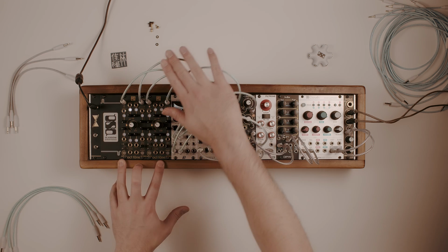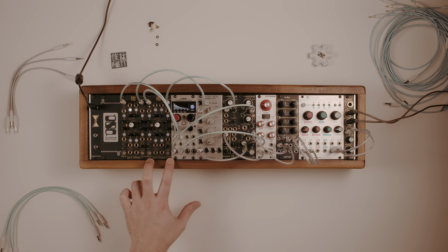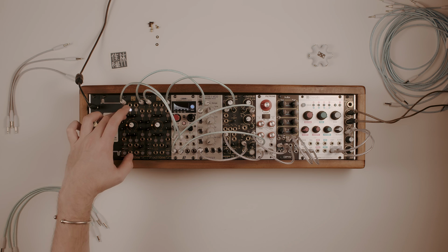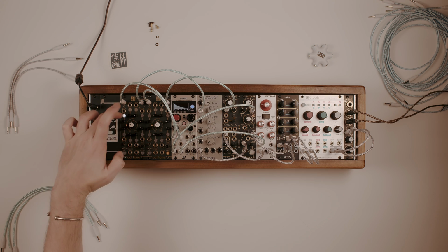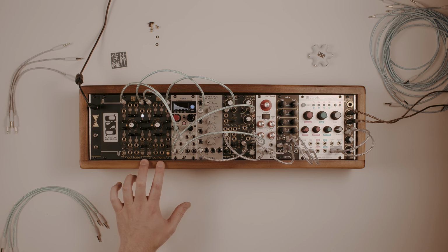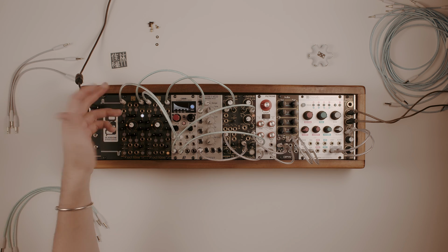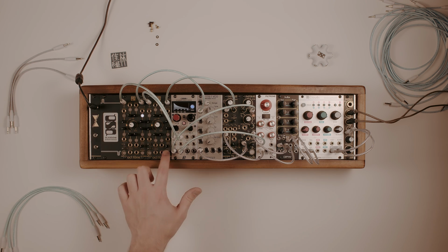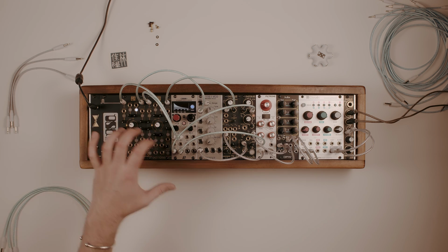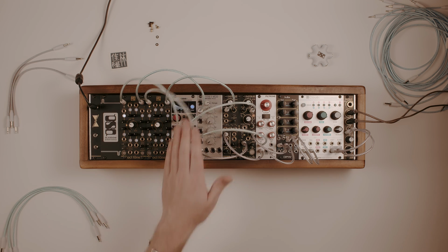A couple of things going on to note. We have regular stepping on the right side, but not the left side. So if I go back to my tune mode, we'll be able to check with the same double tap approach to enable or disable the assignment of the step repeats triggering the master clock output. There's an extra LED here, so this can also be used for a toggle state for engaged or disengaged to the master clock. So let's try this now. So this should be clocking on every step repeat.